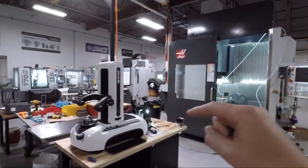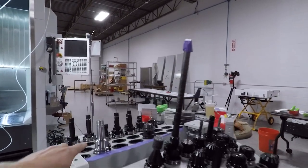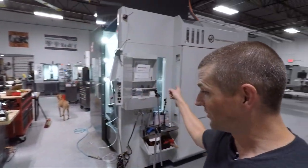That's the reason we bought the Speroni to test indicated runout, and why we've got some of these different holders and styles — like this Kaiser high-end collet system and that hydraulic tool holder. We want to understand what happens when you run a tool in different holders, different gauge length, different stickouts, different indicated runouts. It's what I feel I've been called to do — take all the information I've gained over the past 10 years and help other people understand how to run and cut materials. Thanks to everyone who supported and signed up for the beta list. I'm excited to finish up this part — everyone have a great weekend, take care, see you soon.